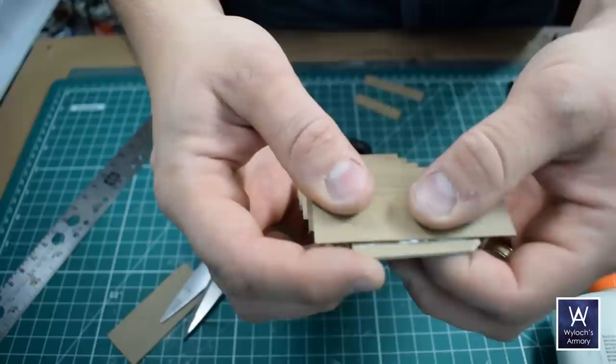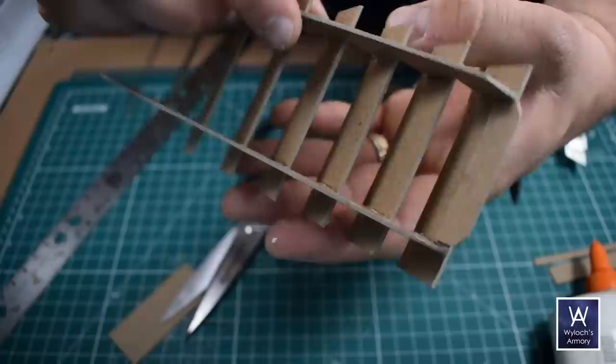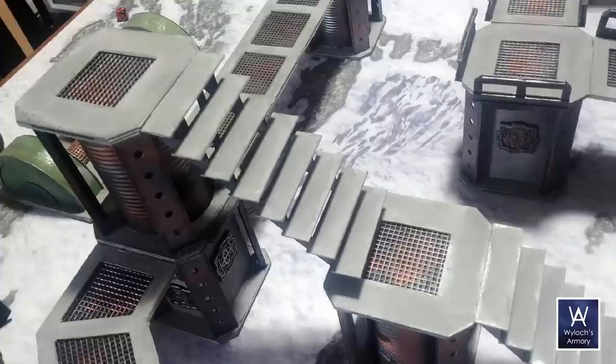Finally, a simple two inch tab glued to the underside of the topmost tread. If your tower height is different than mine, the thought process is the same — use an even rise over run ratio to keep things simple, and pick a number of treads that divides evenly into the height. If you need to fudge the overall height, you can get away with up to a millimeter of cheating. So that's stairs.